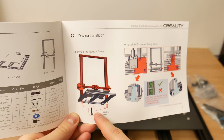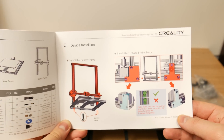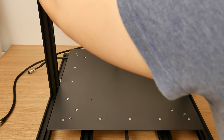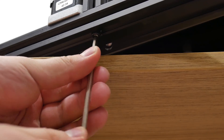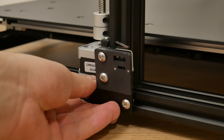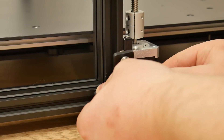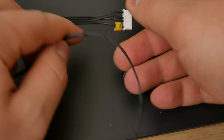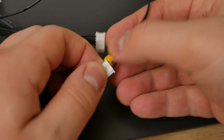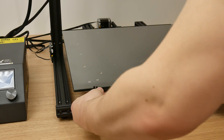In the book we see what we need to do, and yes, this whole assembly fits on only one page because there is just so little to do. This top piece goes onto the bottom piece, obviously, and then it gets attached together with 4 M5 bolts. For both sides we have to install those D-shape fixing blocks — the one with the Z-axis top switch has to go to the left side. Repeat this for the other side and the printer is assembled. Now wiring — this won't take more than 2 minutes. Every wire has a little marking for which axis it goes to. Now we can finally start this printer for the very first time.